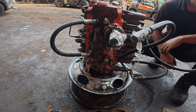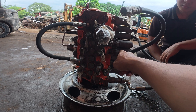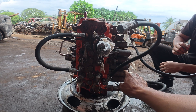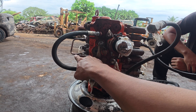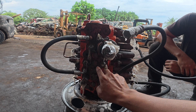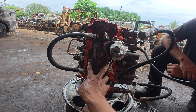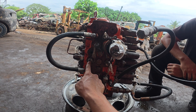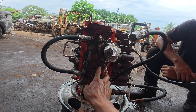From the control valve, we can see that this line right here is for one movement — let's say this is for the boom. The section for the boom movement will be from here all the way down until here. You can see there are two outputs, which means there are two supplies to the hydraulic cylinder: one is to extend the hydraulic cylinder, and another one is to retract the hydraulic cylinder.